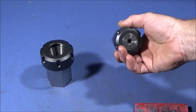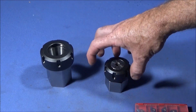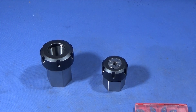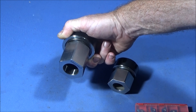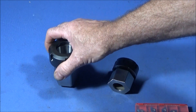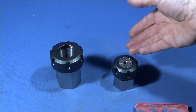I find this the easiest method of actually removing that back end. There's not much to hold on on the nut and you can't hold on the thread, so if you try to hold that in the jaws without a live center in the back, the material is so hard that it would probably rip it out of the jaws and cause a lot of damage.